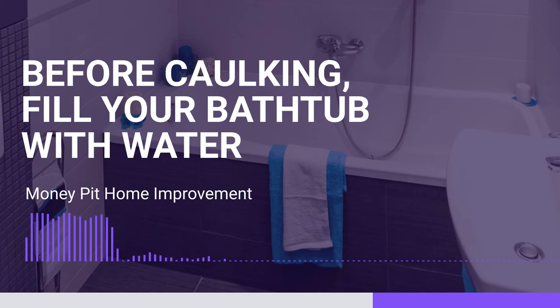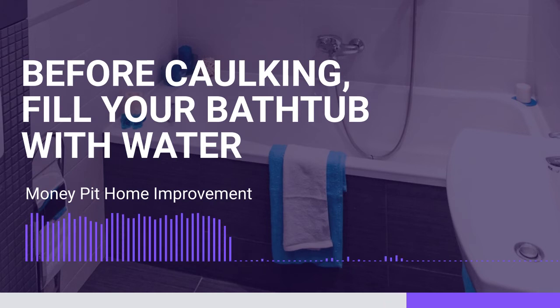What if there's not enough green board going all the way down behind the tub? See, that's what I think is a problem too. Then what you want to do is caulk that gap, and you do it with the tub filled with water, because this way, after the caulk dries, you can let the water out and the tub will sort of go back up and compress. And when you step in the tub and take a shower, it's not going to pull down again, it's not going to pull out. So clean it really good, fill the tub up with water, caulk it, and then let the water out, and you will be good to go. And you'll have a caulk joint there that's really going to last a long time.